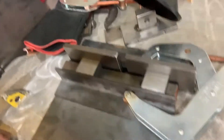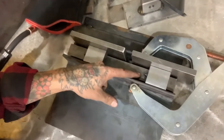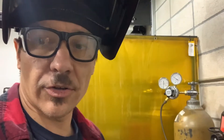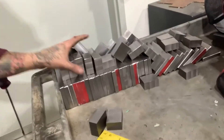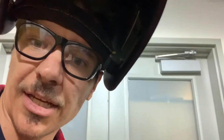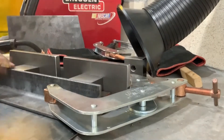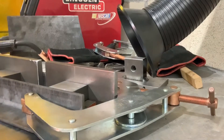Make sure everything's touching what I want it to touch, then snug it up so everything is snug. You can see the seat clamp and those pins right there — that's what's going to be locating exactly where I want these welds to be recreated. If I ever want to make more of these — and looking at this stack of ones I've already been working on, we're at 24 now — yes, I need 24 dies. I'll be able to repeat this process fairly simply. All of this work I've been doing is really aimed at making things easier in the future. Now let's weld one together and see how it turns out.